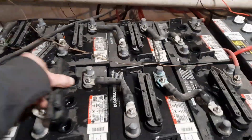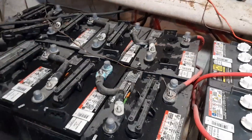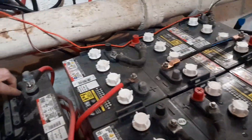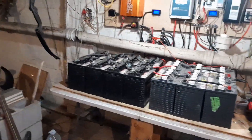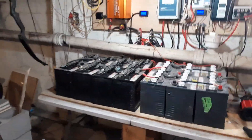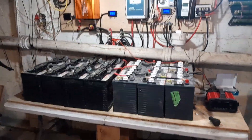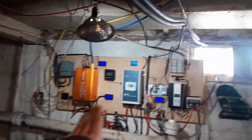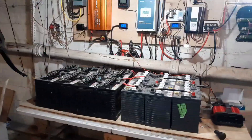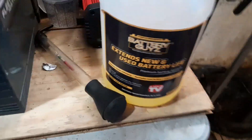The six-volters are still rough but they did improve, so it's not a complete loss. I'm happy I did see improvement. They're still pretty beat up, but maybe it'll continue to improve as I keep charging. Something I might do is keep the inverter off for a couple days and just keep a trickle charge on these - that might break down the sulfur and improve the chemistry.